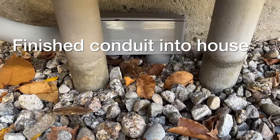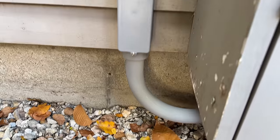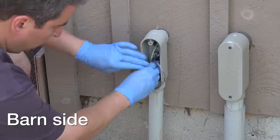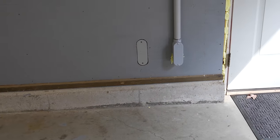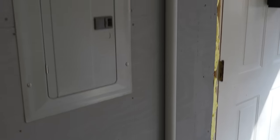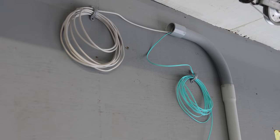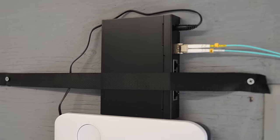This part is going to be different depending on what you've got in your structure. I love to use this electrical conduit — it's cheap, easy to work with, and for things like fiber or Cat5 cables it'll give them complete protection. When I was done, this is what it looks like in my workshop. I brought the pipe in through the conduit, there's a little access panel, then it goes up the side of the wall. I ran the pipe up towards the ceiling to make sure the fiber was away from the floor so I wasn't stepping on it or causing any other problems.